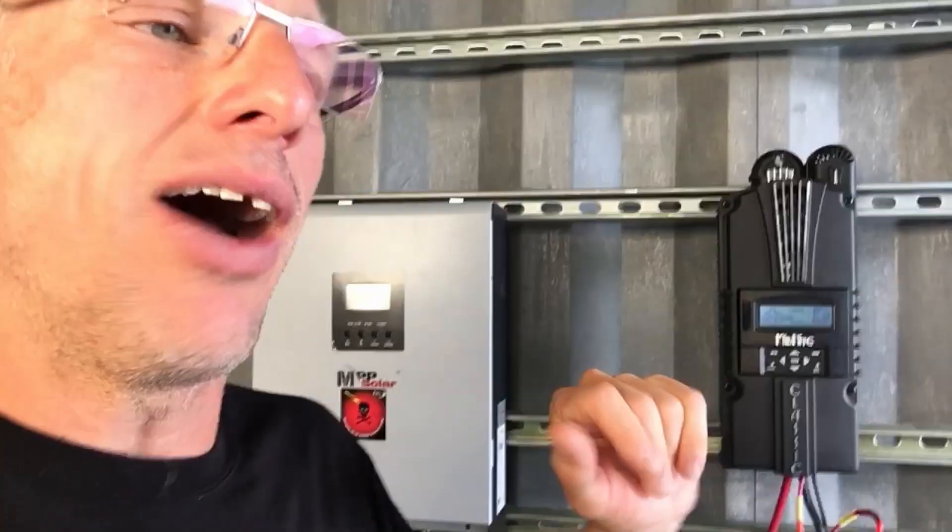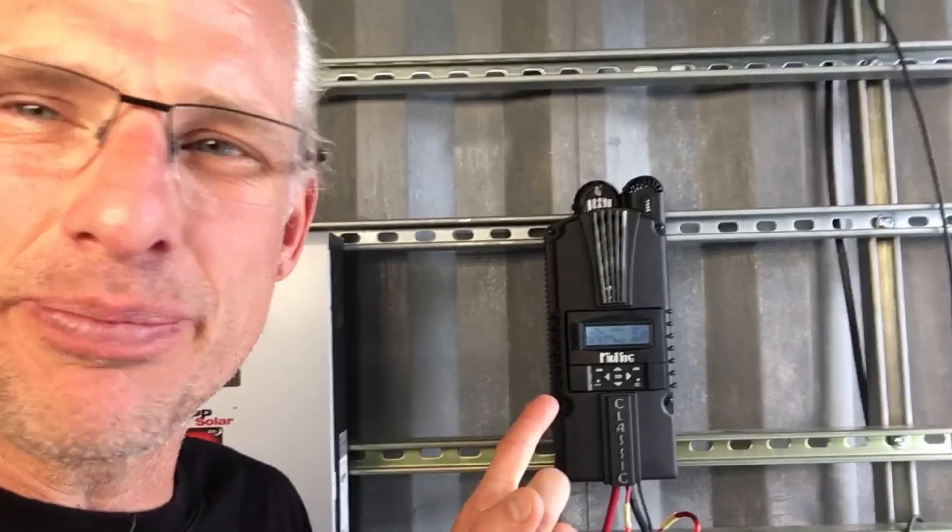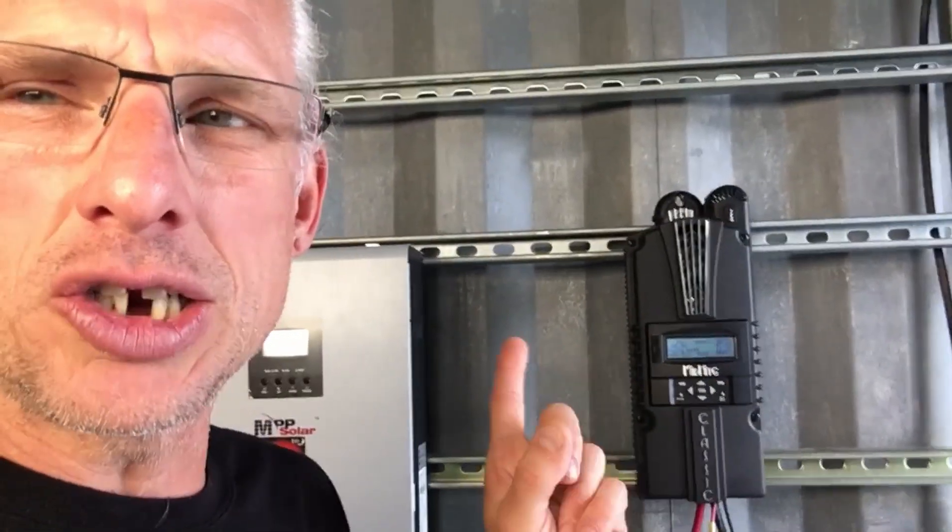I've got that truck power source but I'm trying to get rid of that. I was basically thinking the solar system was just gonna run itself. I'm at solar peak right now, so as the sun starts to recede I can just start to put more panels. I'm already planning my more panels. I've already got the layout. This is a 250-volt, 60-amp charge controller - I can put a lot of panels. I have a huge stack of panels still that I need to mount.